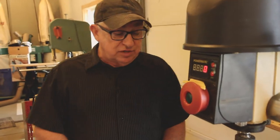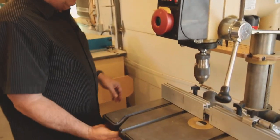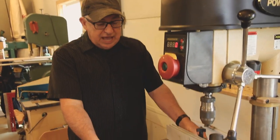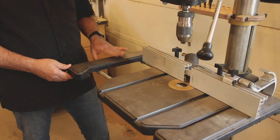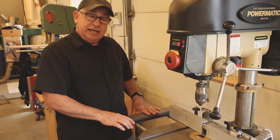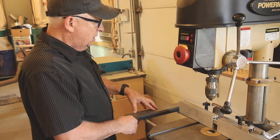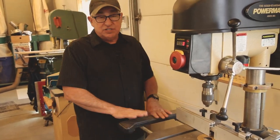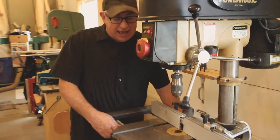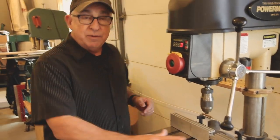Here is a great feature — this table, as large as it already is compared to what you usually see on a metalworking drill press, actually gets even larger. That's done by reaching under the table, undoing the two clasps on the bottom, sliding the table open, and re-tightening the clasps on both sides. You've now extended the table size, making it much more stable for longer work. This puts off the need for outrigger tables a bit longer. For moderate-size work, it works just fine. To return it, you simply open the clasp, shove the piece back, re-tighten it, and you're back to the initial configuration.